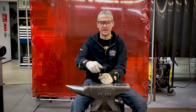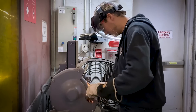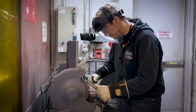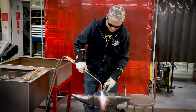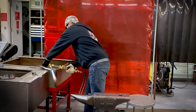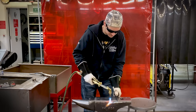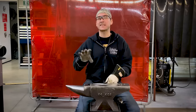Now that I have the paint removed, I'm going to take this over to the bench grinder — the pedestal grinder — and reshape the ends. But I don't want to put too much heat into this, so I'll gently grind out what I need. This is going to be a preliminary grind. The next step will be to take it over to the torch, heat it up red-hot above the critical temperature, and quench it in water. Then we'll reshape it one more time and apply just a little bit of heat — enough so that it gets a golden yellowish straw color — and let that sit.